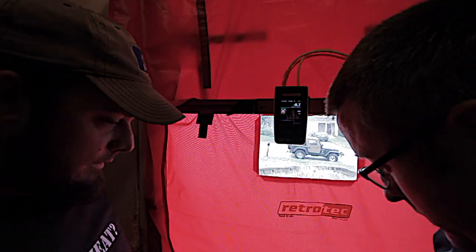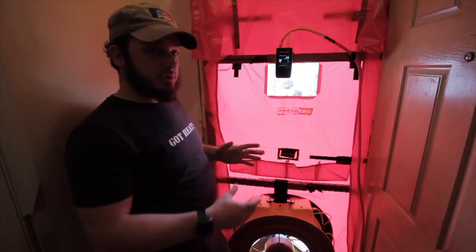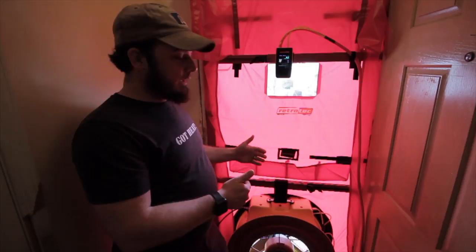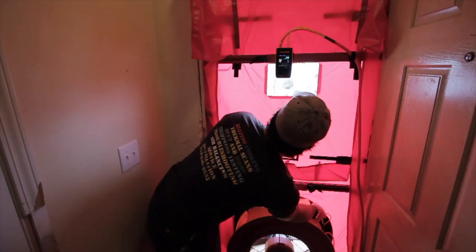You want to back up a little? Part of our issue today is that I had ordered an additional gauge for being able to run the door and the duct tester at the same time. And since FedEx hasn't showed up yet, we need to set the door to 25 manually and then move the gauge to the duct testing equipment. So there's a knob here on the side, and we simply turn it until we reach 25 Pascal.